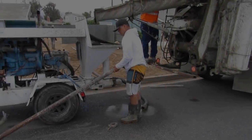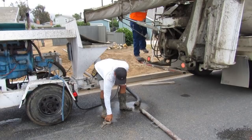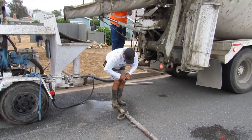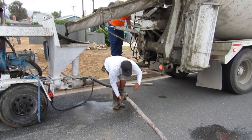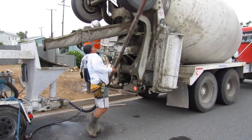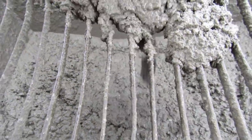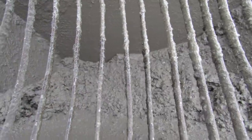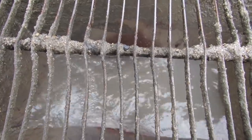Here I am washing it out. I put the washout hook on it — you just clamp your hose to it. It has a heavy duty end on the hook and you stow it up in the hopper of the mixer and use a strap to tie it down, because that thing will fly out of the back if it plugs in that hook and you could kill somebody. When washing out, run the hopper all the way down but not where you can see daylight, because water going in there will separate in the manifold. Fill it up with water and keep turning the volume up faster and faster until it's wide open. After about three hoppers — roughly 90 gallons — everything is spotless clean. Some people use sponges but I've just never done it and never had a problem.